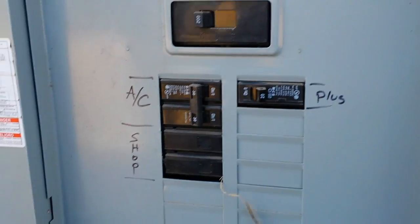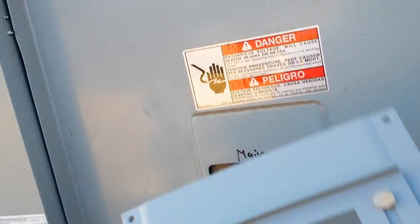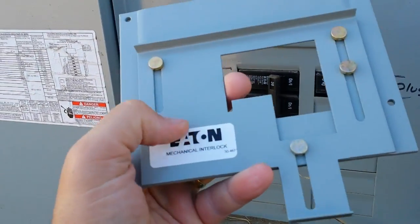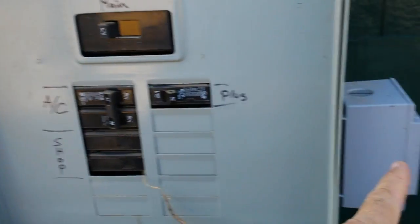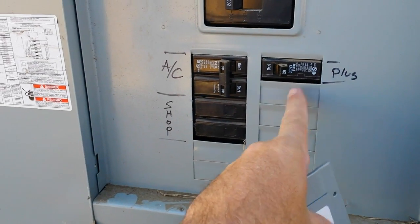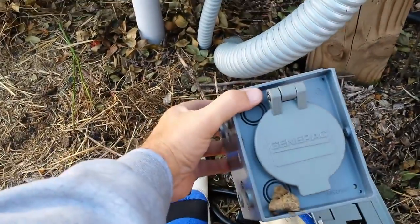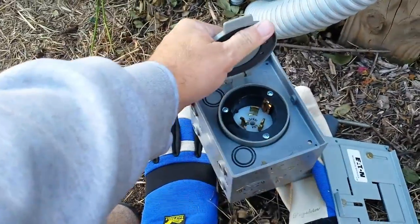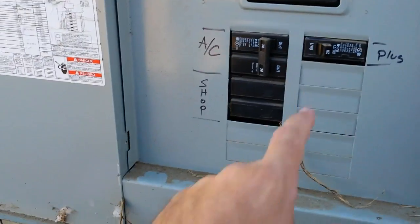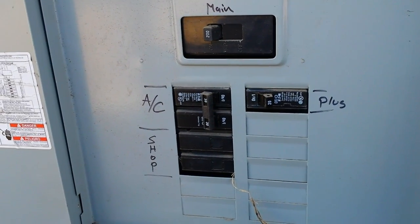It's a pretty easy install — just read up a little bit first. Basically you have to buy one of these for the brand of subpanel you have. When you install, I'll have to move this breaker — this one's for an outlet someone put in here. I'll have to move it down so we can fit the generator breaker. Then we'll install the generator hookup here — basically just a 50 amp cord from your generator to the twist lock. I'll put that on the post behind it and install the new 50 amp breaker for the generator system.